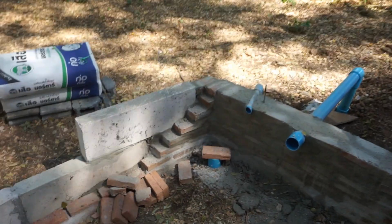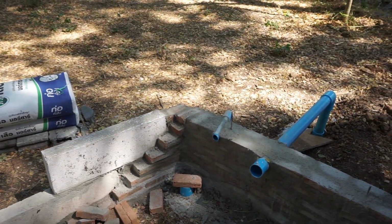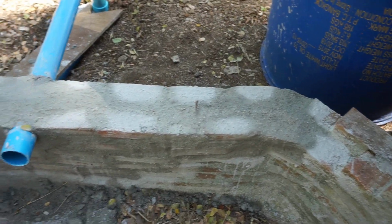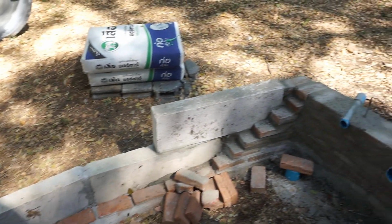So in this corner here, I'll lay the bricks. You can see where the bricks are going to go, and I can just put a little bit more cement in that corner to give it some more strength. I've got this wire. You see the rebar inside? It's only tiny, but I think I'm going to put some wire on that and then bring it round across the top of the wall. And it'll also have the electric wire for the lighting.